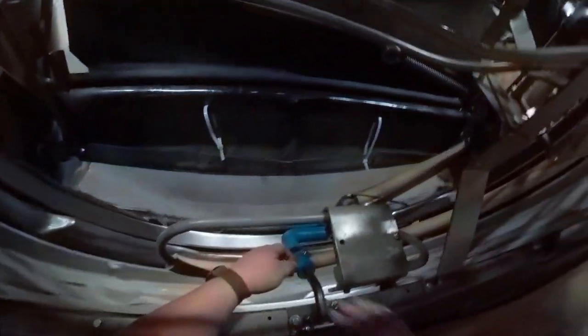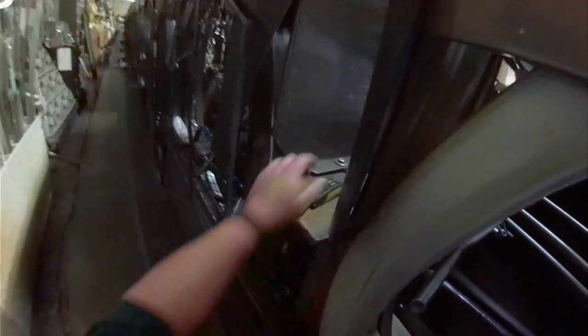So we're going to adjust the upper Liftrods here. We're going to check the lower adjustment because you always want to check both. If you change one, check the other. And we're going to get this up and out of the way. So we got our half inch, 9/16 and 3/4. Those are the wrenches we're going to need.